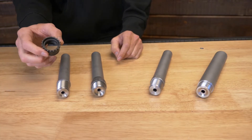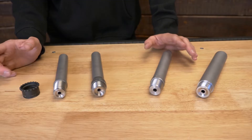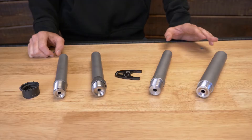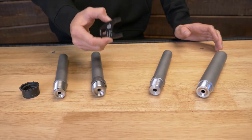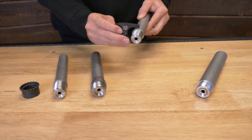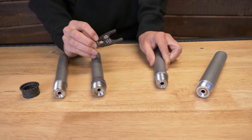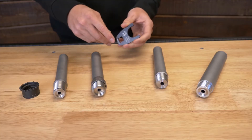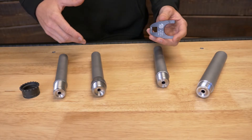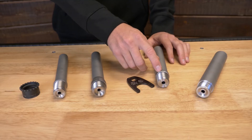That's the RPR concept — it works this way because more people have AR-15 barrel nut wrenches than Savage nut wrenches or the specific wrenches we provide. When checking out on our website, you'll also be asked if you want a barrel wrench. We sell specific wrenches for our barrel nuts that fit just right and have our torque recommendation on them, as well as a half-inch drive for a ratchet. If you're using a torque wrench, put it 90 degrees to that so it doesn't increase the length and change the torque settings — going too tight can mess up the threads on your brand new barrel.